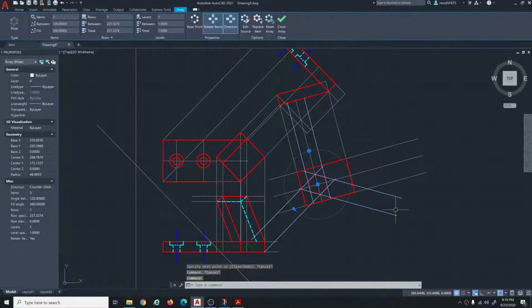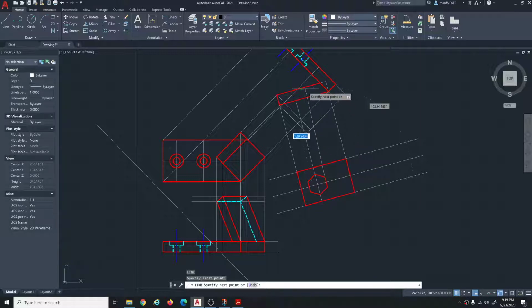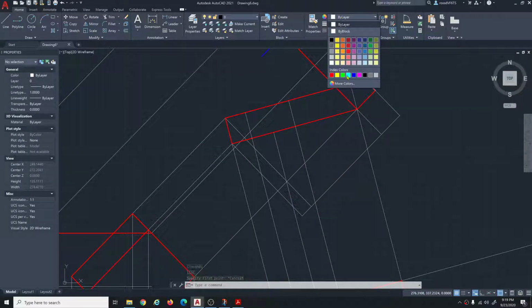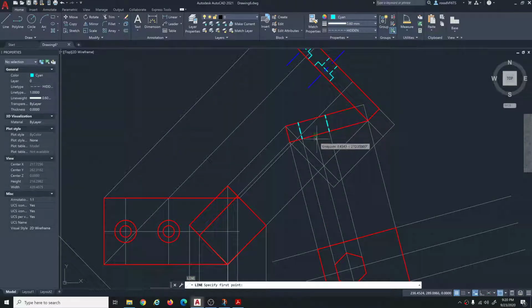That's the flange. I'm going to go ahead and delete the polar array that I did. Okay, that's the flange, the true shape. Let's go back and finish up the hexagon in the other three views. So I'll go back to construction. I'm going to project back perpendicular those 2 points. Now I can draw the hex, which is really just a couple of hidden lines. Let's go to heavy. Yeah, this is a pain. And draw these 2 lines real quick, just so that we've marked those guys, so we know they're done. All right, that's what the hexagon looks like as hidden lines.